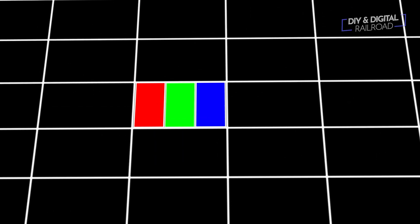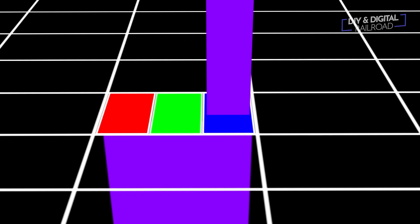LCD screens are made up of pixels. Standard resin printers have RGB LCDs, which means the pixels have red, green, and blue sections. When UV light hits the pixel, only the blue third allows light through. A monochrome LCD pixel is different because it does not have the RGB sections — UV light shines through the entire pixel. This means more UV light hitting your resin and faster curing times, which leads to faster prints.